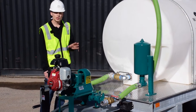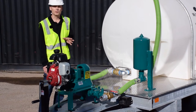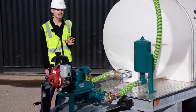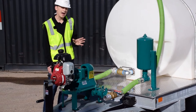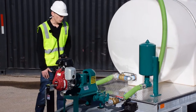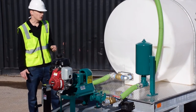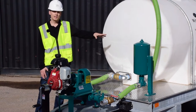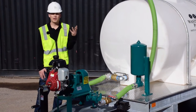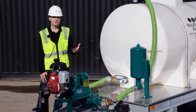To fill this tank we use our own patented Mudsucker diaphragm pump. This is America's favorite diaphragm pump for a lot of reasons, but the biggest one is that it's really easy to use, easy to service, and it's got the power you need to pump thicker fluids such as septic waste and general wastewater. You can pump both into and out of the tank by simply switching a number of valves. This cylinder here to my left is called a pulsation dampener — if you're pumping clean water or very thin liquids, it's designed to keep the pulsation of the pump down to a minimum.